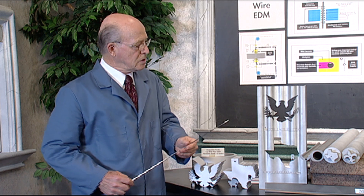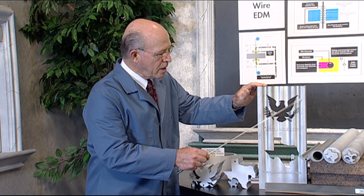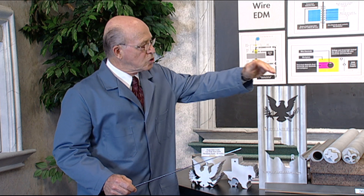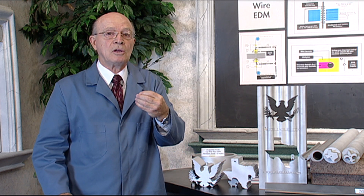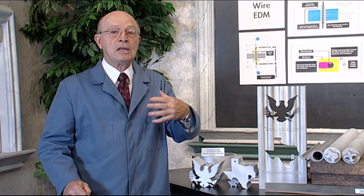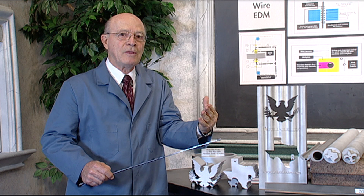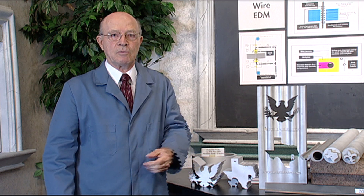The second example is this Reliable EDM showpiece. Here you can see the wire electrode along the whole surface and sparking occurring. We're doing the first one with no water in the tank, just the water rolling along the surface — this again is not the ideal method. This is a machine that is totally submersible. The second cut shows the ideal way to be skim cutting, where the tank is filled with water. You don't get as good a picture in the second one, so that's why we've shown you both ways of skim cutting.